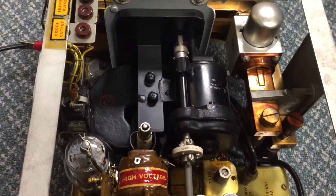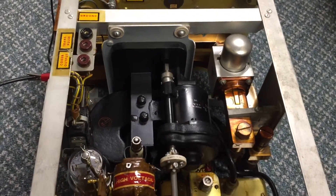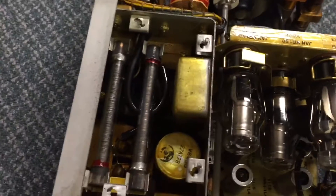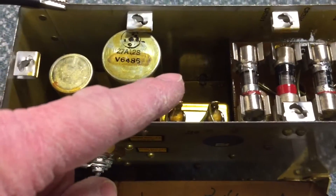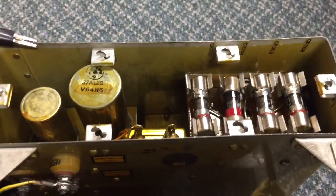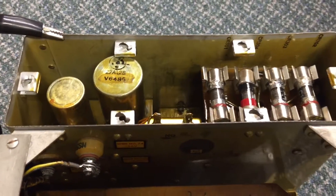I don't really have a test load for 9 GHz, and on top of that, it would probably be bad form to transmit with it. As you can see, it has some rather unusual selenium stack rectifiers. This is the high-voltage section and this is the relatively low-voltage section — the plus 100, plus 400, minus 100, and plus 400, and then a 250-volt power supply as well.